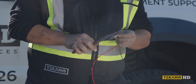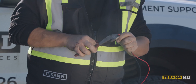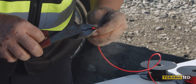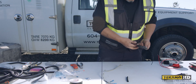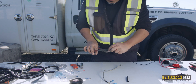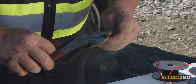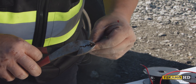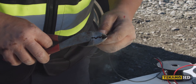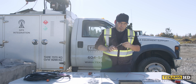Then we're going to just remove the end. There's a proper splicing tool that you can get, but I got used to using just my side cutters — they have a nice sharp edge to them. So when I cut into the insulation, I'm not actually cutting through it, I'm just wearing it in a little bit. I'm not tightening it, and then I just pull it off. We're removing about half an inch to three quarters of an inch, then get our spade connectors.